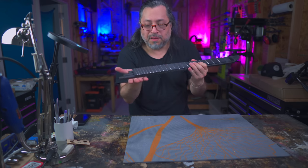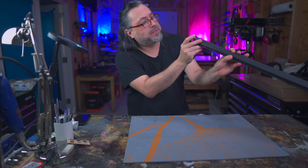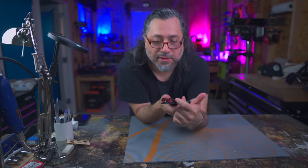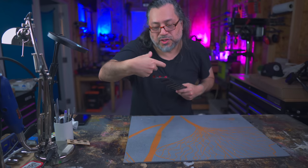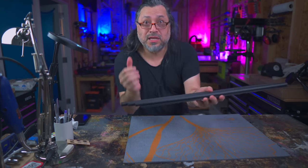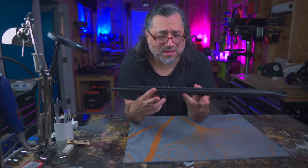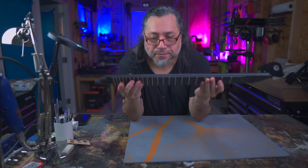And then once we put this on the body, if we do feel like it's not going to work, I do have the opportunity to squeeze a little bit more epoxy in those little triangle corners. When you put circles together like these, there's a little triangle in between each, and I can just syringe epoxy down those channels so it flows all the way down. That might give it a little bit more rigidity and strength, but we'll only do that if we need to. I think it'll work. I don't know if it will, but I'm crossing my fingers that it does. I hope it doesn't blow up in my face, because it's such a beautiful, beautiful concept.